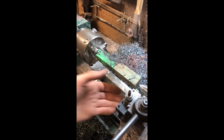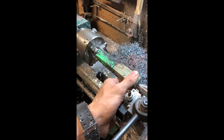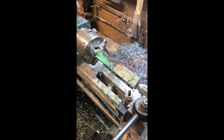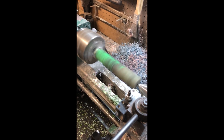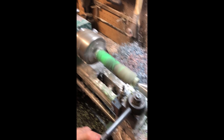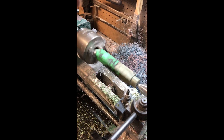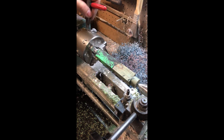Get the tool out of the way, and again punch this dead center. Put that right on your X. Tighten it down, and now you're going to round this side. You can take a little bit bigger pass now that you've got a nice solid portion on the other side. And now you should just about be dead center.